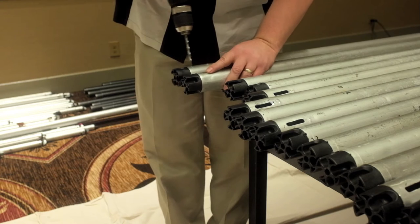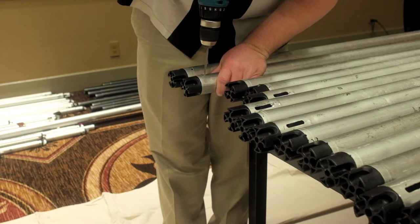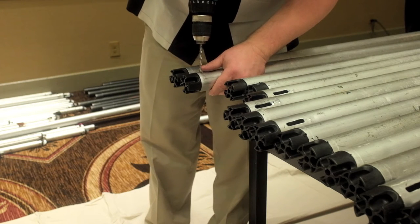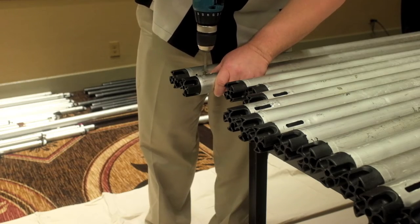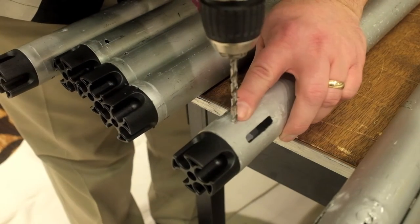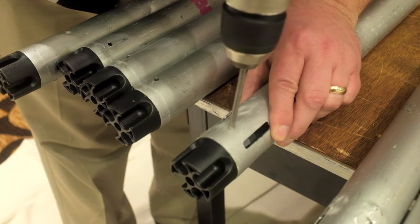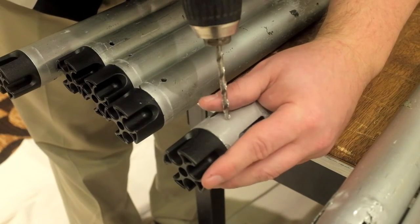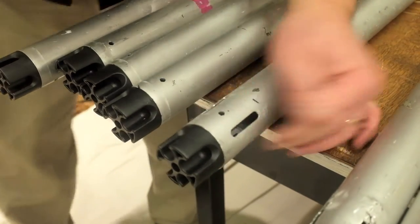Now it's time to drill. To place the drill, you want to come down the solid plastic sidewall of the crown — right between the sockets, which will also be right between the slots if your pipes still have slots. You're going to line the drill bit up with that solid plastic wall in between the slots, and you want to come down about a half to three quarters of an inch. That allows you to drill right through the tab of plastic that's seated on the inside of the pipe. We're going to drill one side, turn it 180 degrees, and drill the other in approximately the same spot.